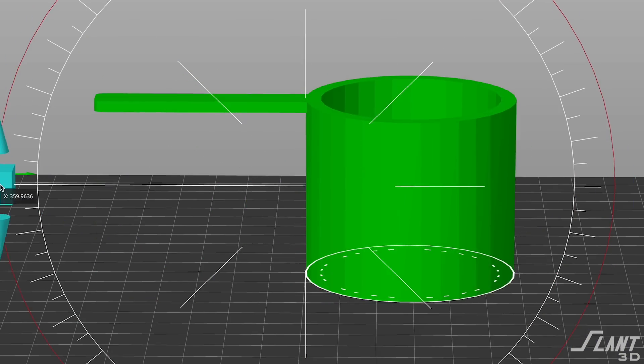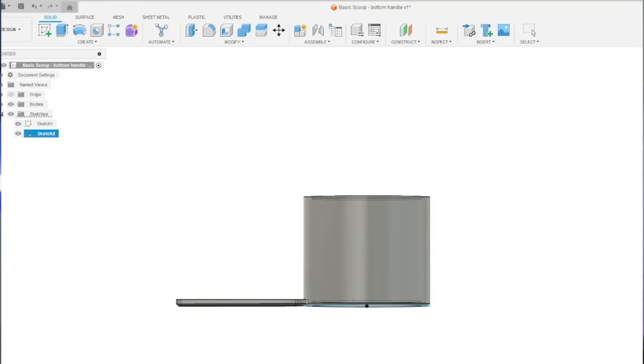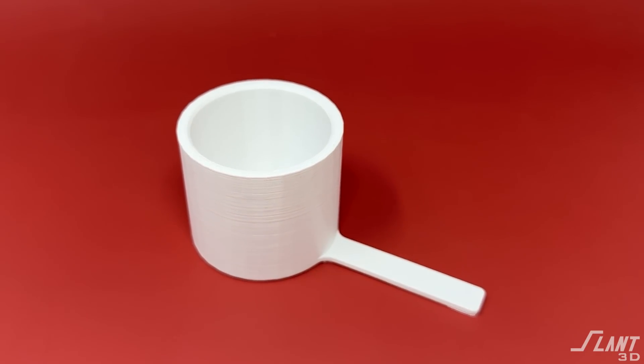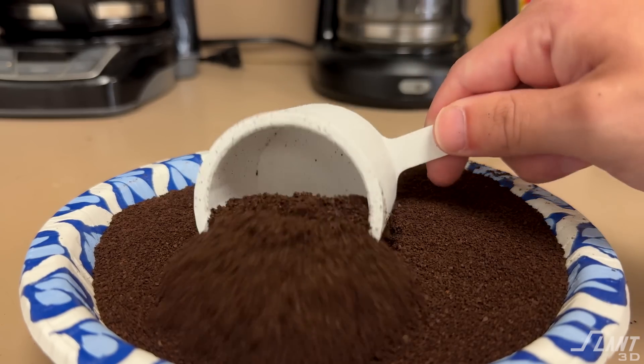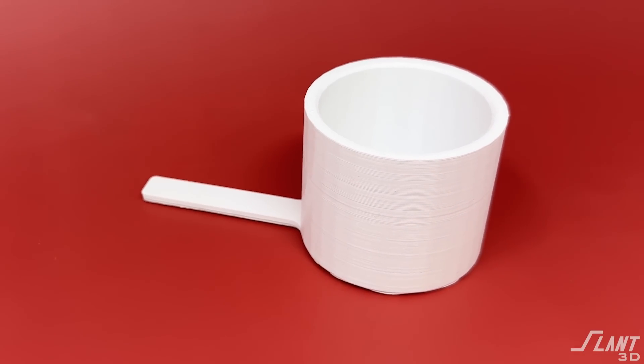If you design a 3D printable scoop from the start, you want to print it bowl up, facing up in the air. But you still have that pesky handle on the side. The simplest solution is to put the handle not on top but on the bottom — against the build plate, with the bowl facing upward. No overhangs, no chamfer needed on the inside. From a user experience standpoint it's actually better, since your hand stays isolated from the powder. Traditional scoops have the handle on top because that's where the mold parting line is easiest, but with 3D printing, you have the freedom to put it on the bottom.